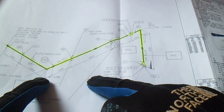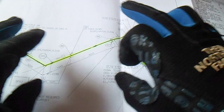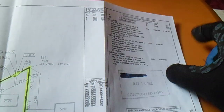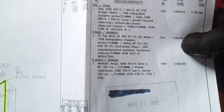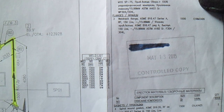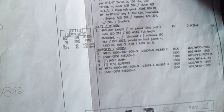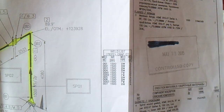First you must know the description of all materials. Here is the material description. In this material description you will see the type of pipe, the type of fittings, what size, what code, and what quantity. Here you will also see the type of gasket, type of bolts, supports, and the weld list — where this weld is and the cut pipeline.